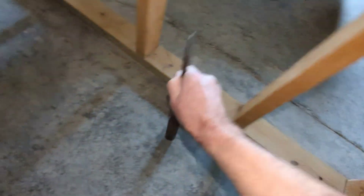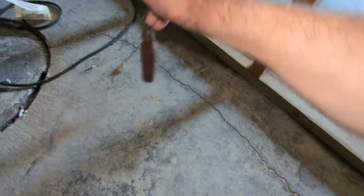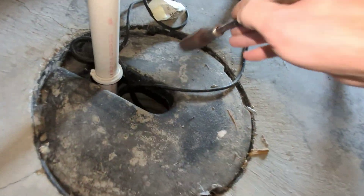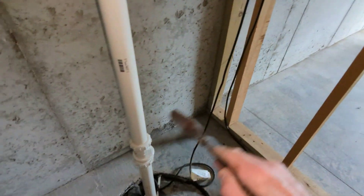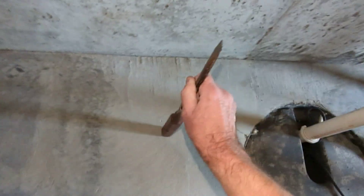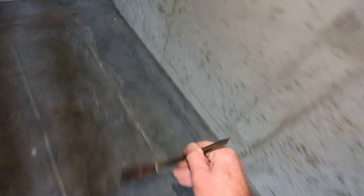Hollow again here. Closer I get to that pit and down in here, that footing tile is coming in right here at this edge. It's an odd location to bring it down the center — usually you would have them around the skirt areas on the outside next to the footing. But inside here, see, there's that footing underneath that wall, and it starts to get hollow inside the slab area.